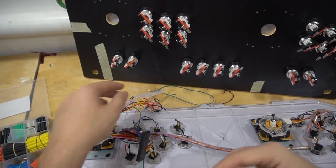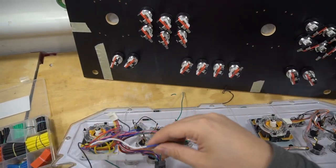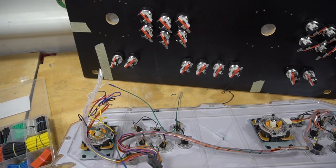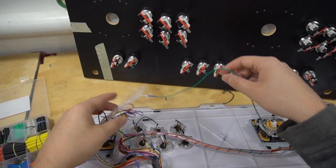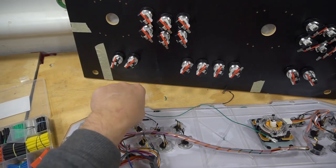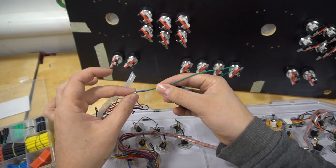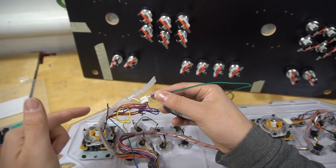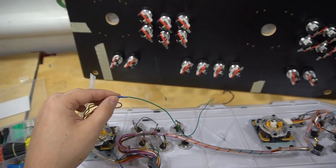That's really it. Pause the video, get all your stuff situated. I buy everything on Amazon. Literally, heat gun was Amazon. The shrink tubing is Amazon. But me as a business, I do need this setup because I like to keep things clean. You personally, if you're doing this as a one and done kind of situation, you could always use electrical tape. But I can't stress it enough, make sure you electrical tape the entire connection. Even if you have the littlest of bare wire sticking out, that could touch a ground, which then will activate the button. So you gotta be careful with that.